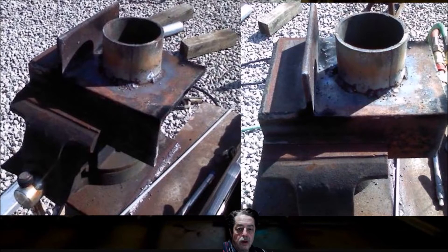Now, this is what I would caution you on. I have one caution here because I've made these and I've also thrown a couple in the scrap pile. That distance between the round pipe and that angle iron going up — I keep mine fairly tight. So let's say I have a piece of quarter inch cold rolled steel and I want to bend it, and I set it in there with a big large gap — you're not really going to get the bend you want. Maybe you don't want to make tight bends; you have to play around with this. What I would encourage you to do at first is spot weld that round piece of steel, fit your piece of steel in there. If you don't like it, use that angle grinder and a cutoff wheel, tap those tack welds, and pull that off. Put it in closer and play around until you get the bend that you want.